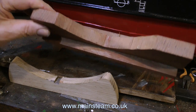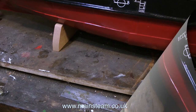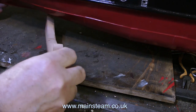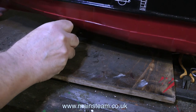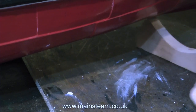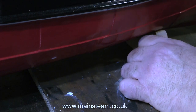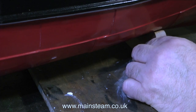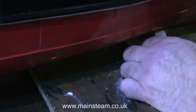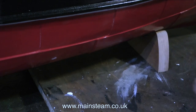Having a quick look at the two boat stand mountings, you can see that one is an original and the other, which I've just put to one side, was a replacement. The original appears to be made out of oak, so I used it as a template to cut one out of mahogany, and I also shaped the top so it accurately fitted the curvature of the hull. The reason for making one out of mahogany rather than using the original was that the piece of oak was a little bit too thick and my mahogany is a little thinner. So I cut two of these out of pieces of mahogany and now I have a matched pair. I'm also going to make a second boat stand using plywood, with two uprights plus a board which the whole thing will sit on, and this can be used when sailing the boat.